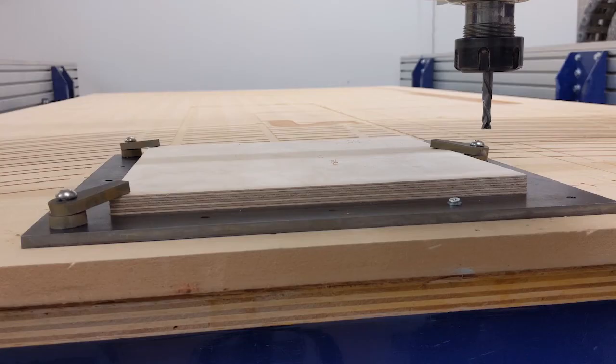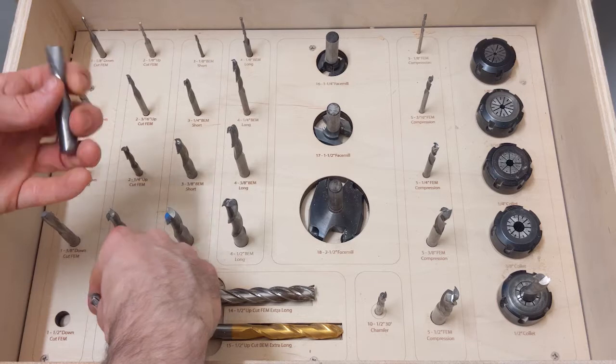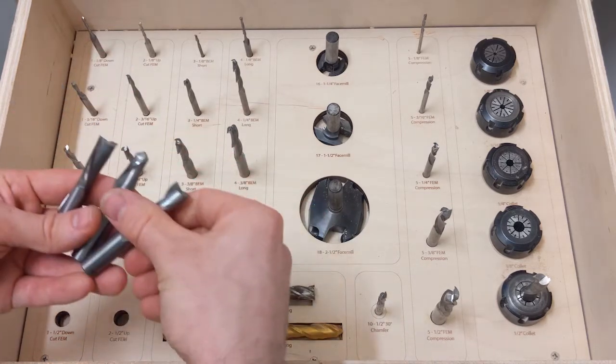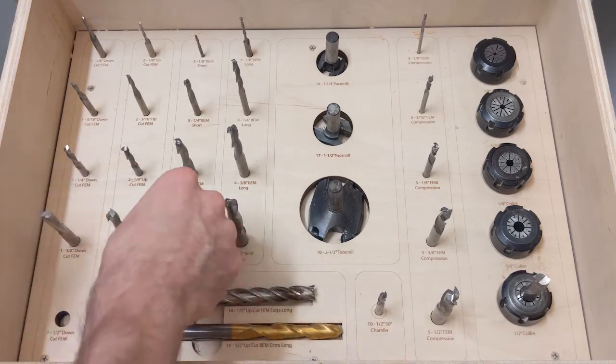If you're trained to use the machine yourself, this section is for you. The ShopBot is an incredibly powerful machine built around spinning razor-sharp instruments at very high speeds. Your hand should, under no circumstances, be anywhere near the cutting head while the machine is executing toolpaths. You should even take great care handling the bits when the machine is off, as they're extremely sharp, even if they don't seem so when held in the hand.